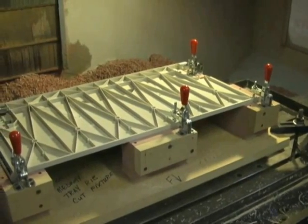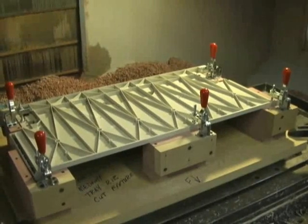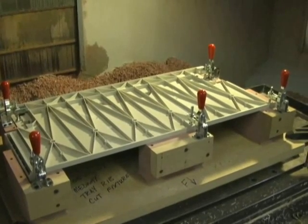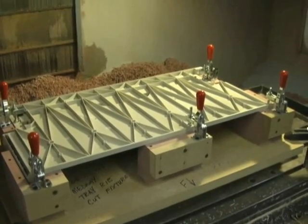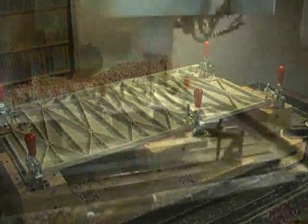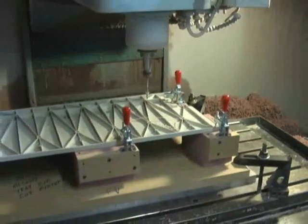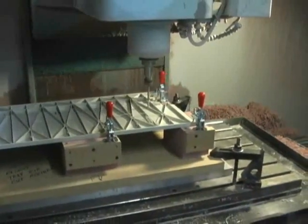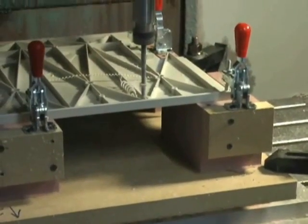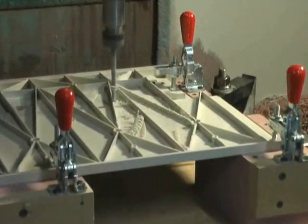In addition, I've learned a lot with what I can and can't get away with as far as the actual machining of the parts. So I'm going to speed up my speeds and feeds to see if I can cut my time in half. That's about it and we'll run a part here and let you see what that looks like. We're picking up here where we're actually cutting the rib structure — pretty straightforward, not all that exciting. We're just mowing down about 55 thou off of the ribs.